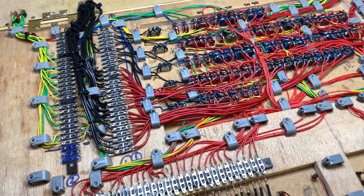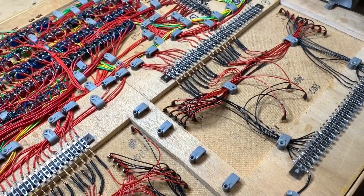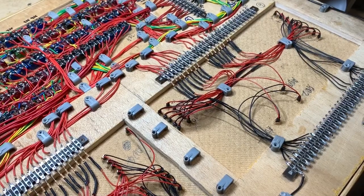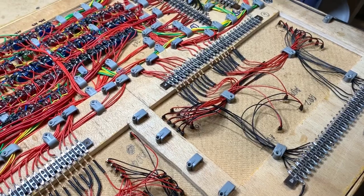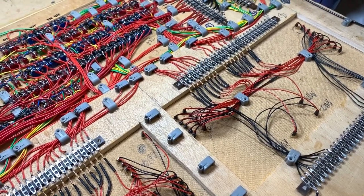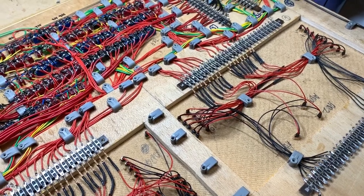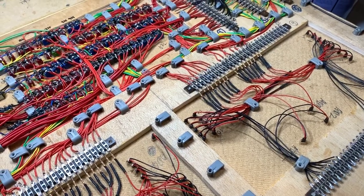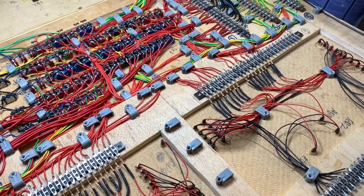The other thing just to reiterate here was for each of those switches, what's also in situ are the LEDs, which go to individual tag strips and then with the relevant resistor and going off to the board itself, so that when the isolating section is on and isolated, there's no LED displayed. When the section is free and power is to the track, then the LED is illuminated, which is already through testing making controlling a lot better than any of the previous layouts.